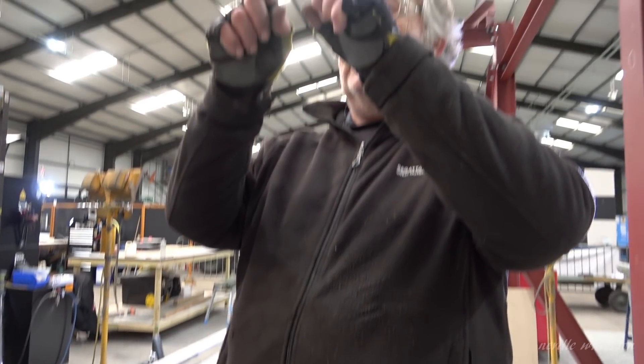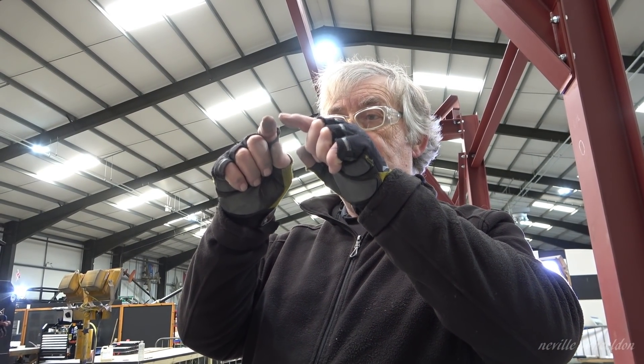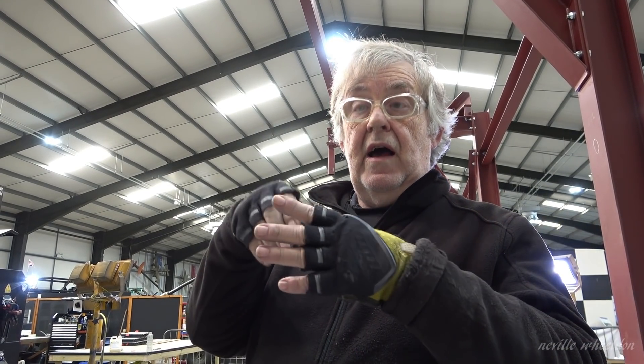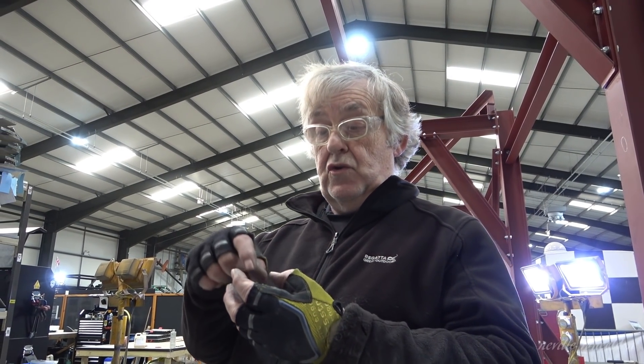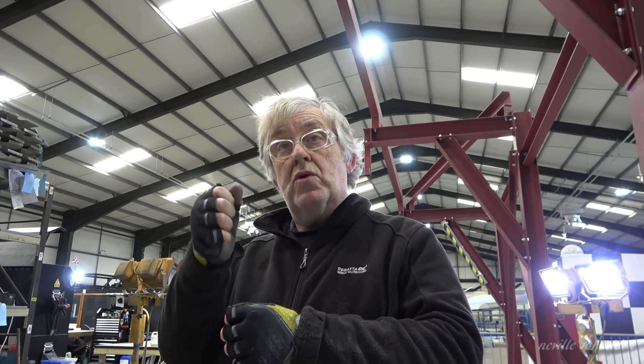At the end of the pin, it's slightly straight and then the end that goes in is slightly tapered. So you push it into the hole and you hammer it in and it wedges with an interference fit into the actual rivet itself. Then if there's any protruding off, you just mill the top of it.